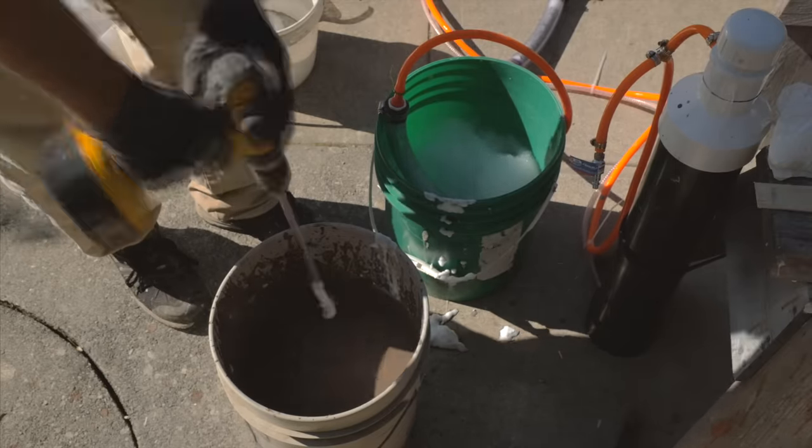The final test — I'll add black cement color to the water, leave out the fiber, but add perlite. I kept the density fairly consistent through these tests, varying the fiber, perlite, and grid, and adding a bit of color additives for fun. I blend as before and pour into the form. When it starts to solidify, I'll add a single wire grid for reinforcement.